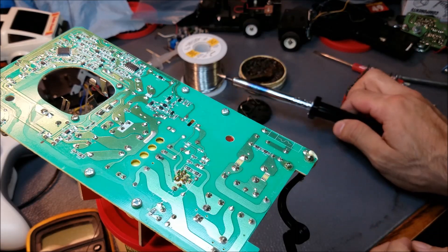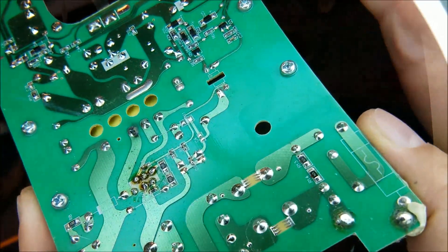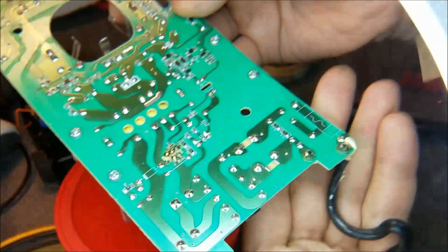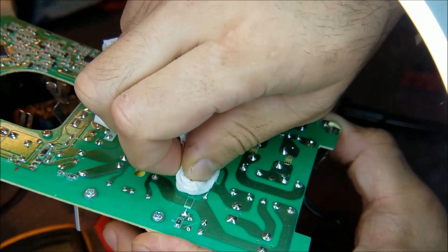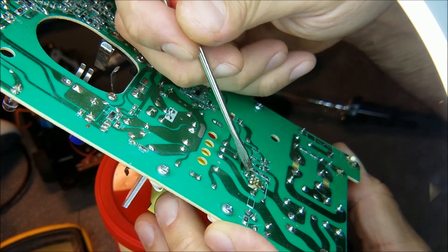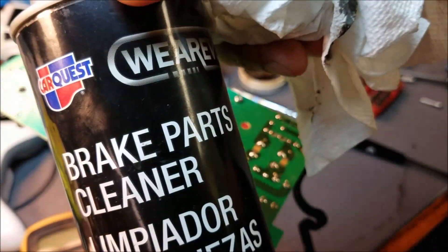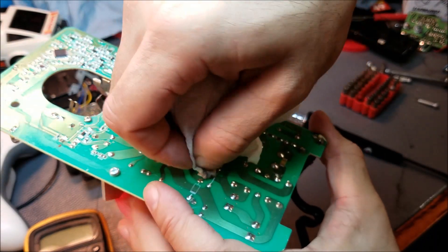Now the soldering is done, it's time for a little cleanup. Whether you're using just flux or flux core solder and flux like I'm doing, it will leave residue on the back of the board. In many cases you can just leave it there and it's totally harmless, but we are dealing with rectified main voltage, which is going to be around 150 volts DC — that's pushing it to the limits of safety, so I'd rather be safe than sorry and just clean it. I use a screwdriver to scrape between the joints to make sure there is no bridging of solder, and also to scrape the flux away with very light pressure. Then I'll use some brake cleaner to soften up the flux and wipe it off.